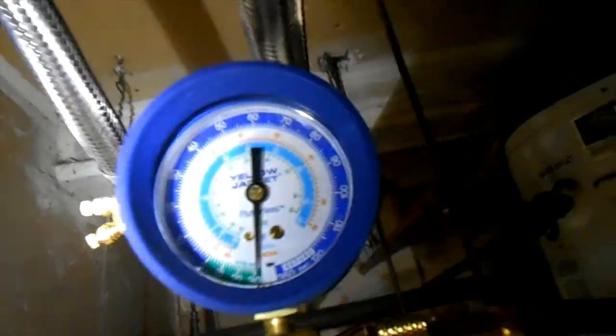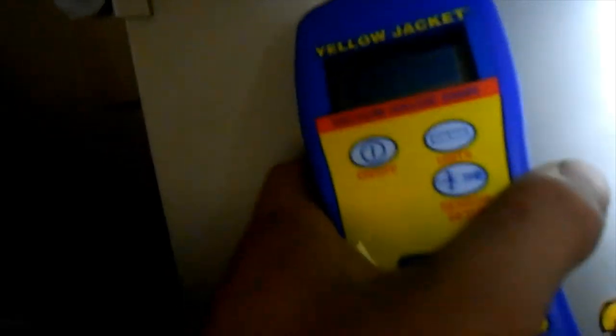Alright friends, we have our service valves raised in here and the vacuum pump working away here, and our brand new manifold kit in action. We got a perfect vacuum supporting that gauge. We got our service valves — high pressure, low pressure — and there's the fan relay to replace the control board. We got our micron gauge here. We're pulling down pretty good actually — two hundred and forty microns.